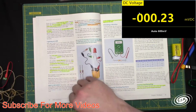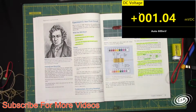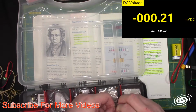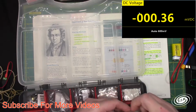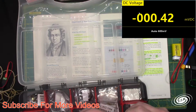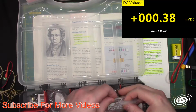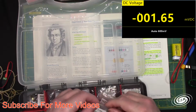So we needed that. Let's just look at what we need on the page back here. Okay, we need a 2.2K, a 470, and a 1K. Okay, here is a 1K. And a 1K should be brown, black, red, I believe. Brown, black, red, 1K. Okay, and then we need a 470. We got a 470 here.